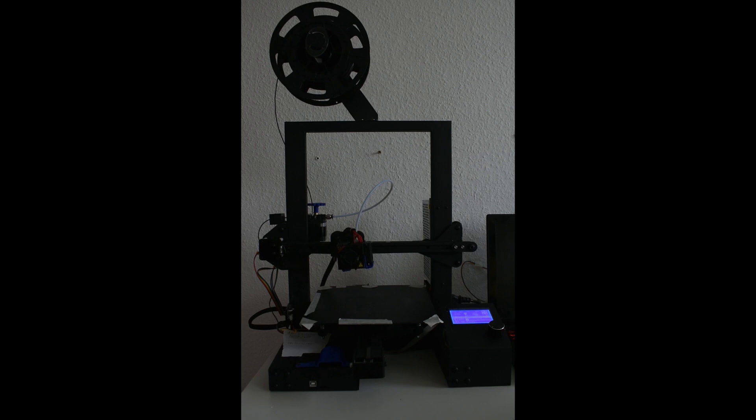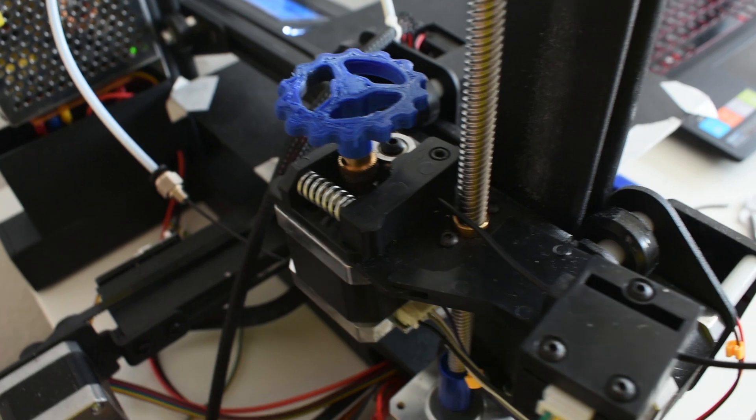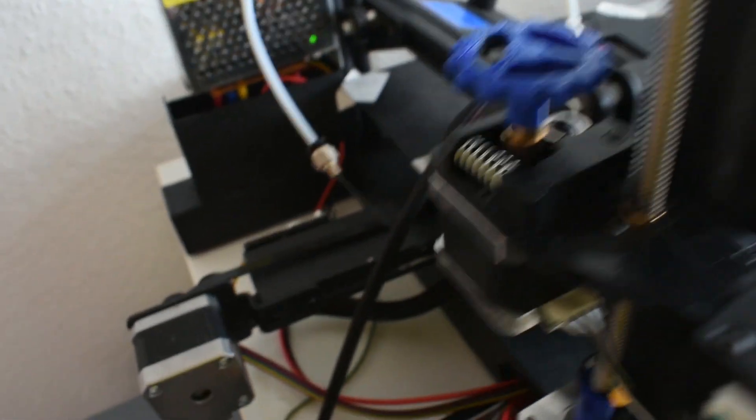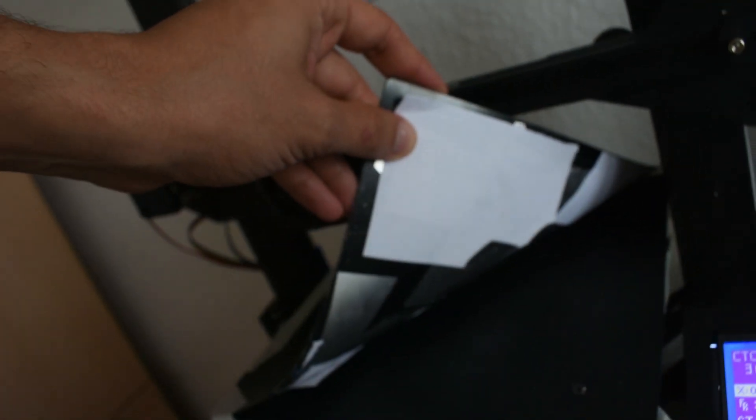Now I will show you the printer, let's get started. First of all, as you can see it's almost the same shape, but there are major differences. For example, it's made of steel, not aluminum like the original one. However, it has a filament detector, and it also has the same dimensions, but the bed had glue on it and had a lot of warps, so at the beginning it was very hard to do surface leveling. I found a solution — just to use some aluminum foil.